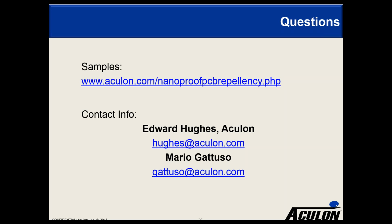Next question that's come through is how the UV tracer impacts the capabilities of the waterproof coating. We haven't found any impact from including the UV tracer. It's one of the benefits of the molecules we're choosing, that you don't need a lot of them per weight of formulation. So you're talking somewhere between parts per billion and parts per million of UV tracer in there.